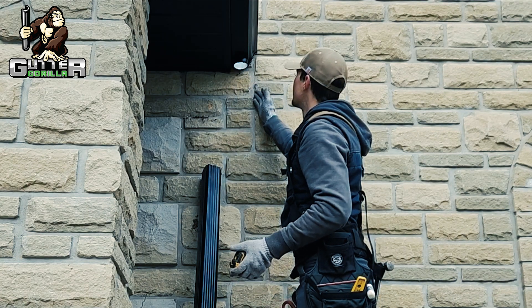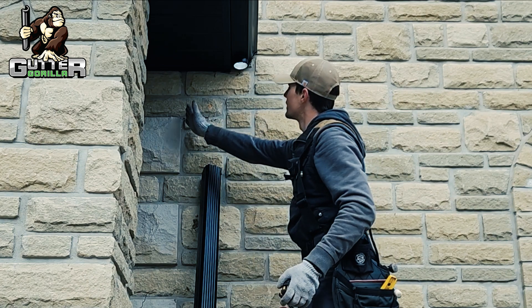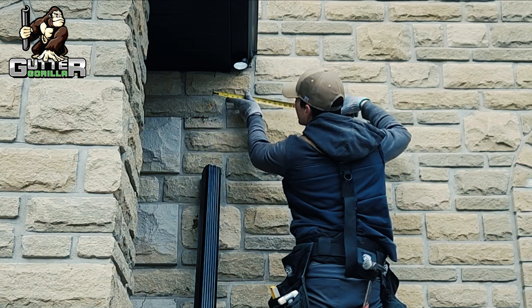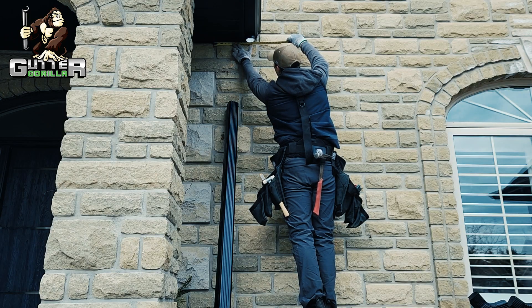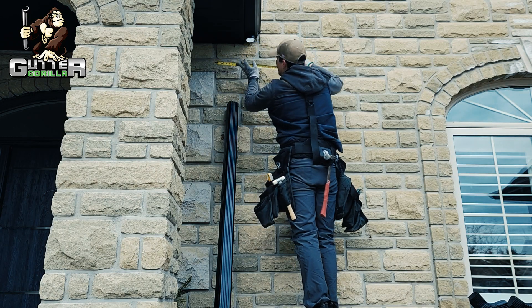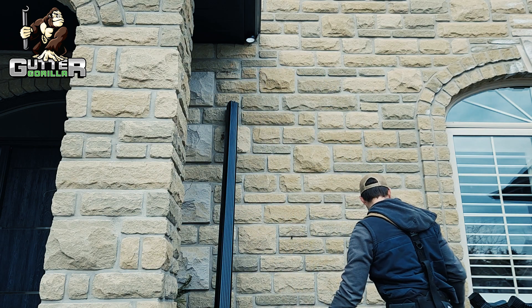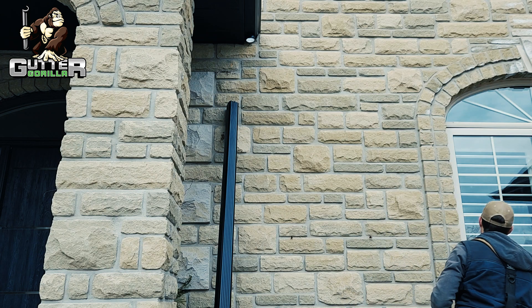This one is a little different — it's not going to a wall per se, but let's say this was your wall and you wanted to bring this pipe that way. You would get your measurement from there to the end of the outlet. We have 13.5. Then you're going to want to take that measurement and subtract 9, so 13.5 subtract 9 gives us 4.5.